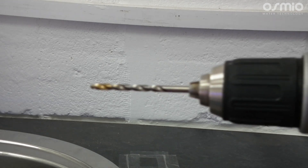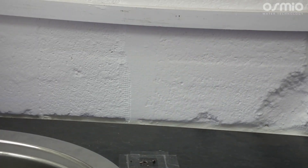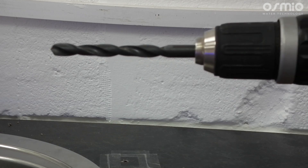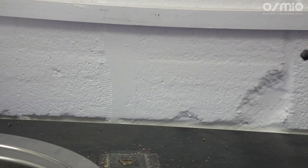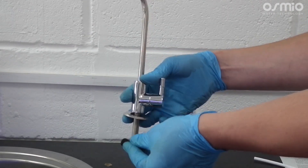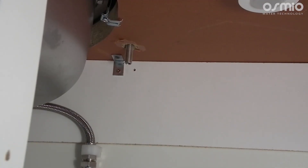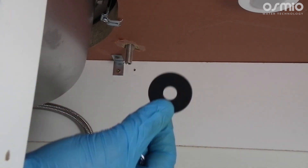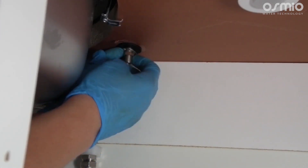We will first drill a 5mm hole using the 5mm drill bit, and then drill a 12mm hole. For the next step we will take the tap plus the decorative base plate and the rubber gasket, and then place the tap through the worktop. On the other side of the worktop we will now use the other parts to fix the tap in place: first the faucet nut, locking washer and the flange. First you will fit the flange, apply the parts as shown, and then first tighten by hand and then with the adjustable spanner.